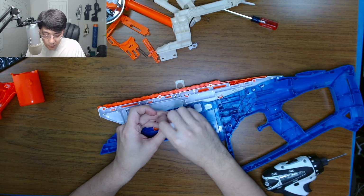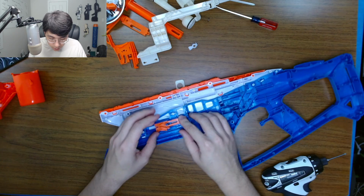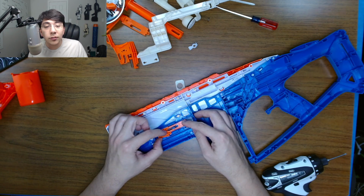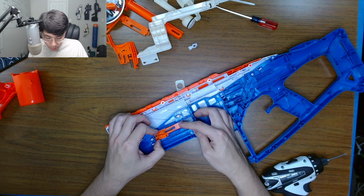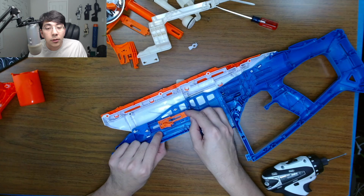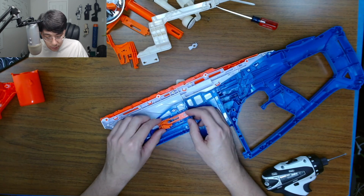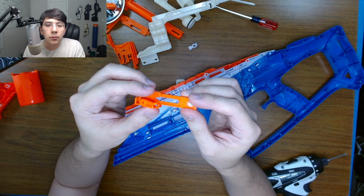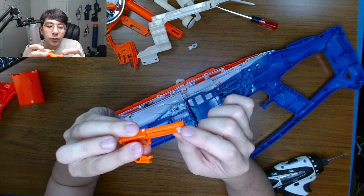See, it's fine. This is a short screw. So there is one more short screw. It's the same size screw that's right here. Alright, now let's look at this. So this entire thing, so there's a tension spring here, pulling it back this way. There's a cam in here, this little ramp right here in blue acts as a cam, pushes that up. You see that little compliance spring? Interesting. So this kind of moves the thing forward. It's weird.